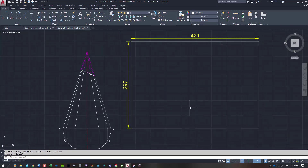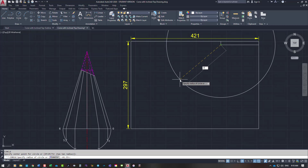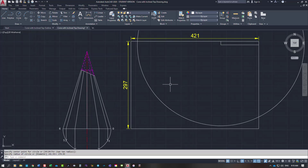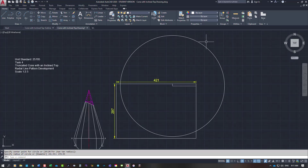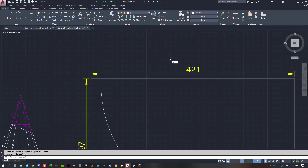I need to measure from the very apex down to point number six — you can see on screen that's 274.93mm. So I need to draw a circle of 274.93mm radius; that's the size of the circle the cone would roll out inside. I'll trim it off to the size of the A3 sheet, then project a line across as the start position for the cone.